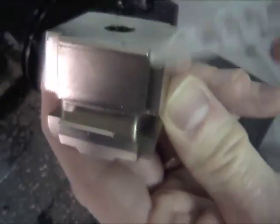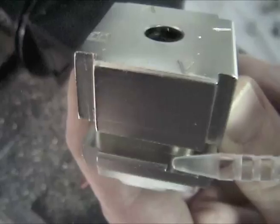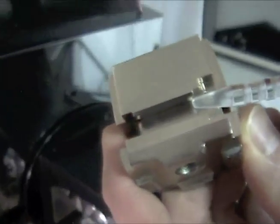One of the other two sides has a lip on the top jaw, and the other side has a lip on the bottom jaw. These sides are used for double-sided automotive keys that are held on the keyway and allow you to cold-cut both sides of the key.